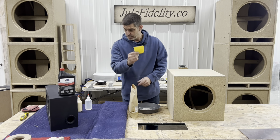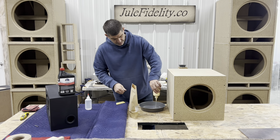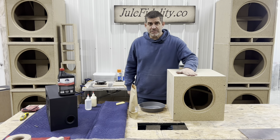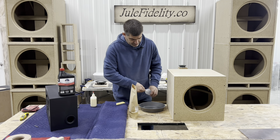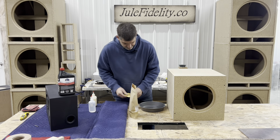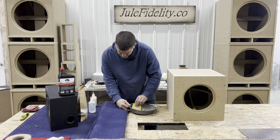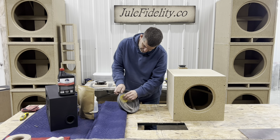We're gonna do the first batch with the spatula. I've got a little bit in there and we're gonna put a little bit of glue in there. The glue is only for adhesion — that's what the glue is for. It has a little bit of water so it comes out of the bottle a little nicer. We didn't sand any of this, so we want to be able to adhere to it, because if we don't sand it and we put our filler on without any glue, it will just blow right off when you go to blow it off before you paint it.